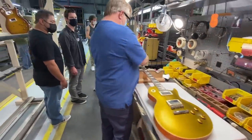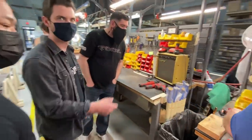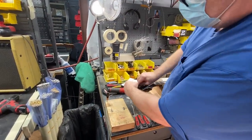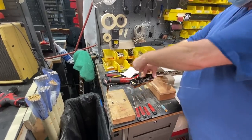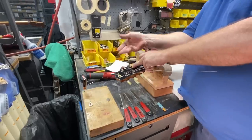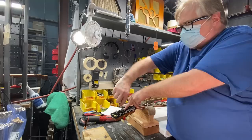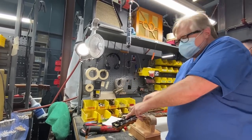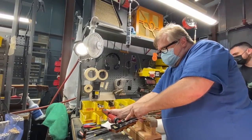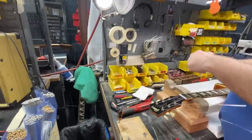Watch it again. What I do is I pull it through taut, then I go about an inch and a half, or maybe one peg length, then pull it back and wrap the first around the top. Okay, yeah. And lift up. Yeah, that's it. And what that does for me is put the excess on the outside so I can just clip them off all at once without having to get on the inside of the post. That is fantastic. Kind of why I do it that way.